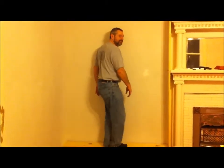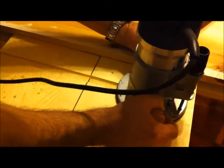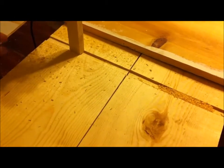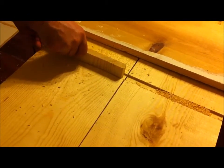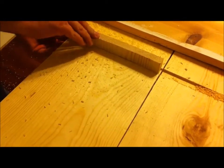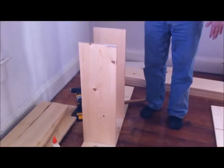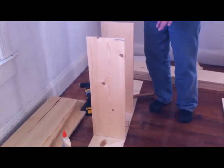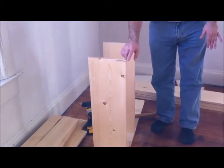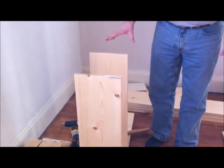You can put it in the shelf — it will fit in there. Oh yeah, that's perfect. Now I glue it up and put screws in here too. I've got all the shelves cut now to the same length, and I've got my notches cut out. I'm test fitting these two pieces to make sure they fit okay, and I'm going through and sanding just the rough edges on each side so there won't be little splinters sticking out everywhere.